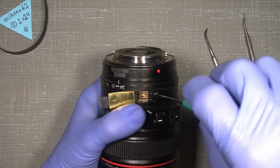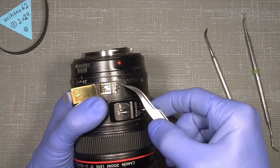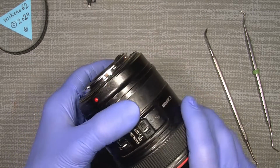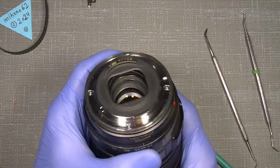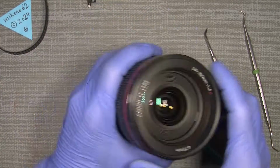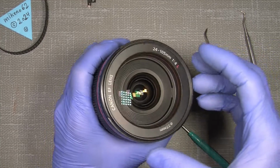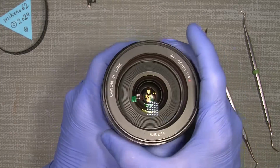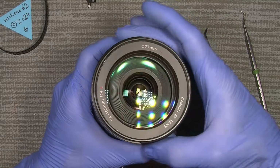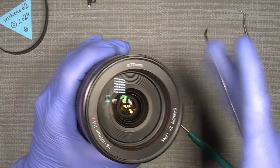And that's what we begin with. So, with that, and out with the little brush here. So, and we can just close this again. So now what I found out when I took apart my own lens was, if we go into here first, take out the whole front lens group, because then it will be, in my opinion, easier. Maybe I'm wrong in this way, but it will just be easier to put in the focusing element here. You see, it can be a little tricky, if not.